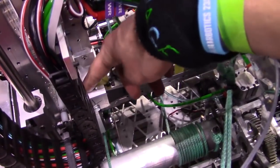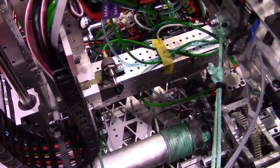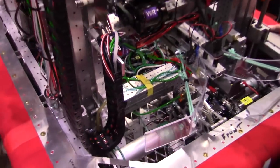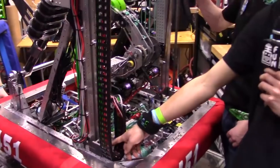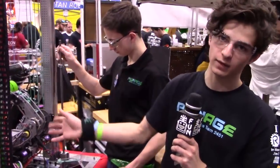And this winglet, which is spring-loaded via a pivot point, and that surgical tubing flips out. And then that would be up here when that happens. And it'll push this pile driver through some linear bearings, through the center frame, pushing up one side of the robot. And then the intake lifts to the other side of the robot.